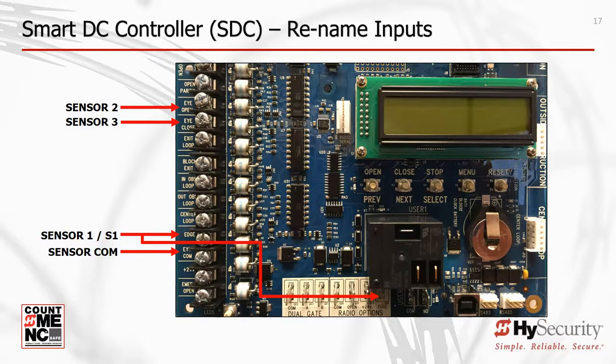If you need more than 3 sensor inputs, use a Miller Edge device called the Solution, which adds 6 sensor inputs. The Solution adapter connects to 1 or 2 of the sensor inputs, depending upon how it is to be used.